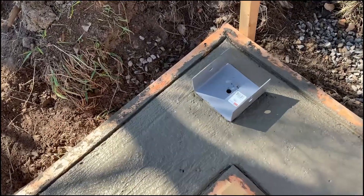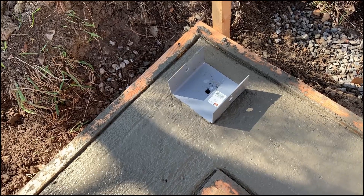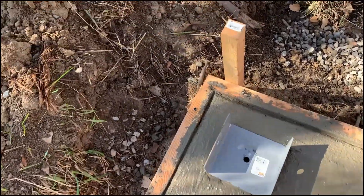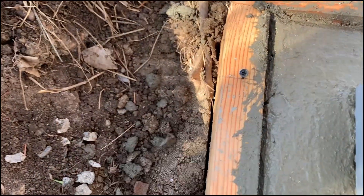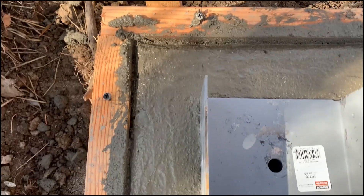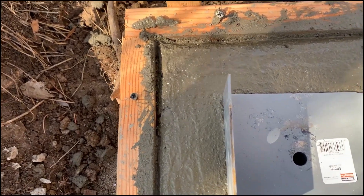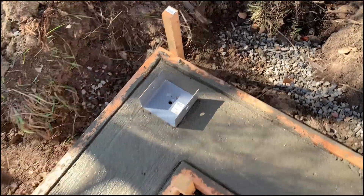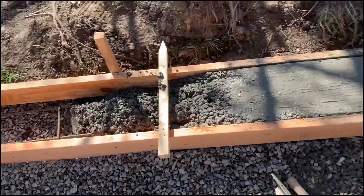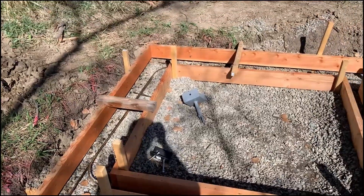I just wanted to set this corner post because this is really a three-man job that I'm doing myself, and I was starting to set up over here. So I finished this corner and set this anchor — the screws are set at the mark so the anchor point is three inches away from the outside of the bond beam. I'll pull strings at the end and see how everything's looking. The challenge now is to work from both sides of the pour so I don't get a cold joint and work it around the rest of the way. That's one corner in.